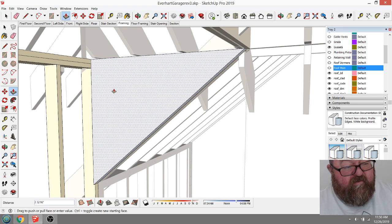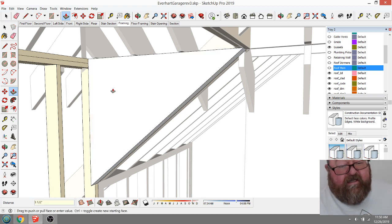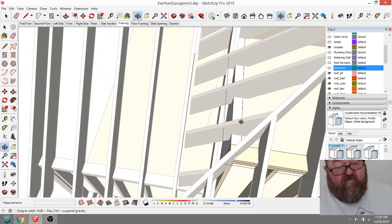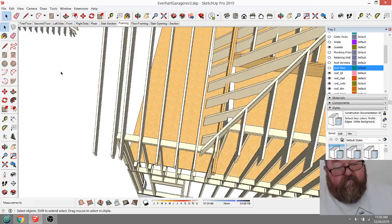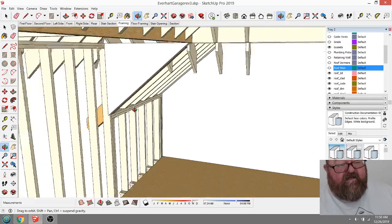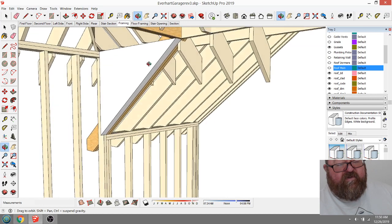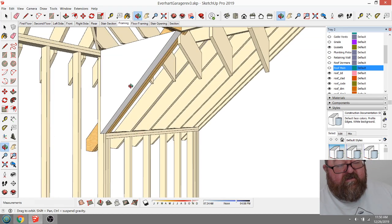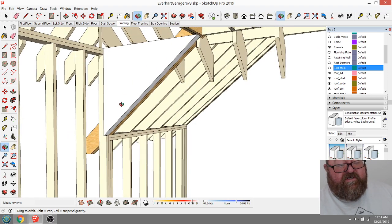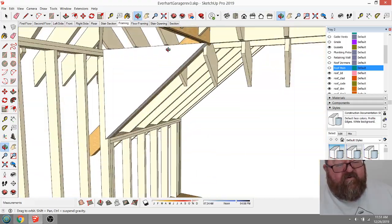And then bring it out to where it would be, it would be 3.5 framed like that. And that would just visually show you where the little framed wall would be. We'll just let that be, and I'll go back in and actually turn that into studs and a plate. The reason I can get by with that is because I can hang each one of those studs off of this LVL. I can just put angle brackets on each stud coming down. And see, that gets my rafters over too.